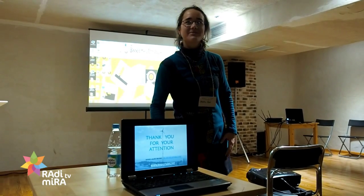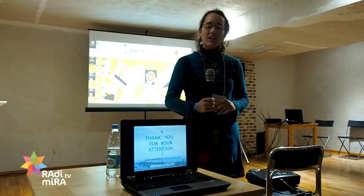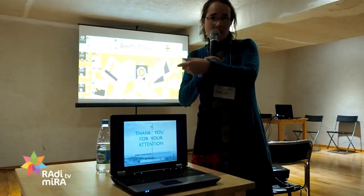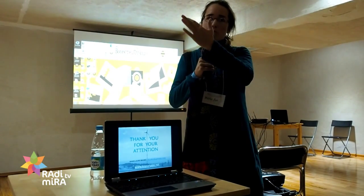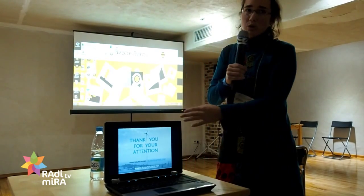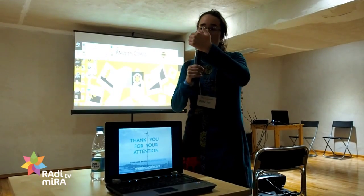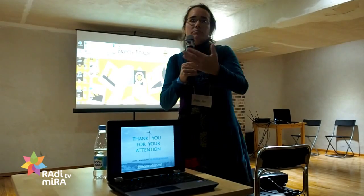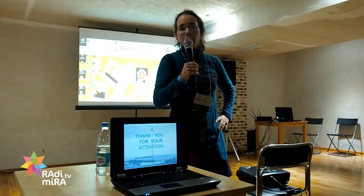We have a question. 1.5 kilowatts from what wind speed do you take? In general, when we announce a capacity like this, a power, it's at 10 meters per second of wind speed. But for the Piggott ones, this capacity is given for a wind speed lower than 10 meters per second, for example.